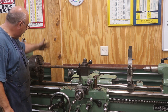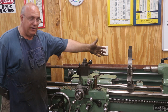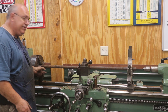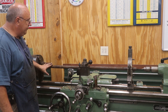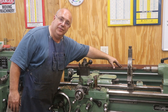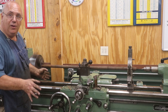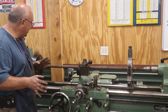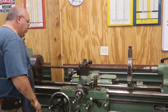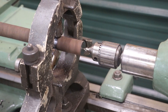I've got this rod set up in my lathe now, chucked into a four-jaw chuck. Notice we've got the crook down here so one of the jaws is sticking out pretty good, and we've got the steady rest. I'm going to drill a center hole and put a center in there to hold it while we're threading. There's a pretty big bend in this end, so I've concentrated on getting minimal runout on the threading end — I'm only going to be threading about six inches. I can't get it perfect and there will be some wobbling, but it doesn't matter.